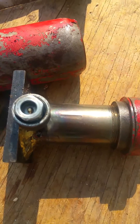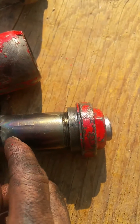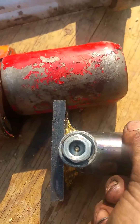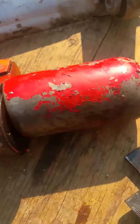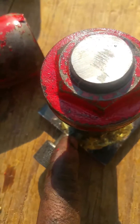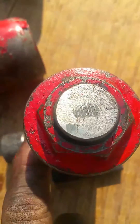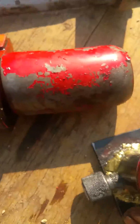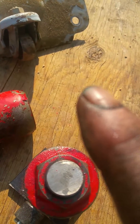I got this piece as long as I needed it — four inches from the top to the bottom of the base. Then on the inside I welded a smaller piece of pipe onto this bottom plate, so when the ram goes all the way down it doesn't hit the threads on your inlet fitting and mess up your seal. Then I welded that piece I cut from the jack onto the bottom plate, brazed around it to make sure it was sealed, screwed it all back together, and cut the shaft down to the right height.